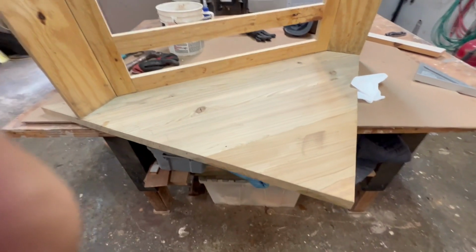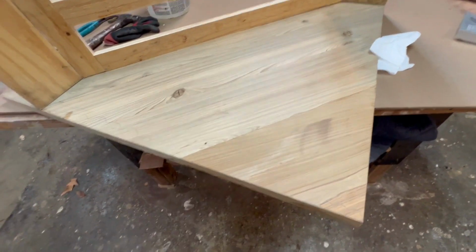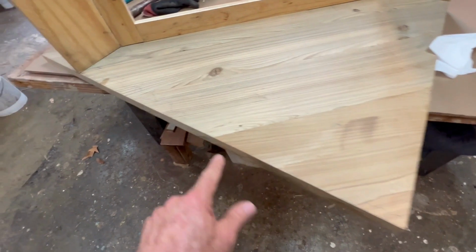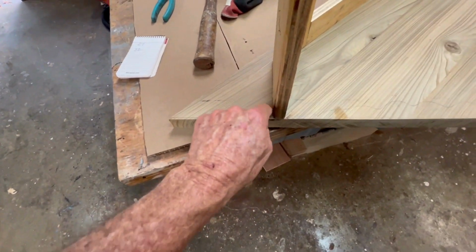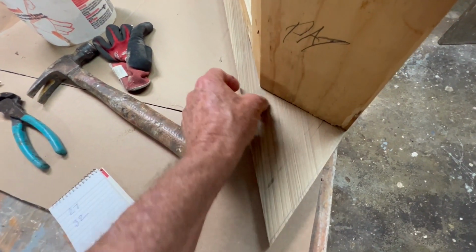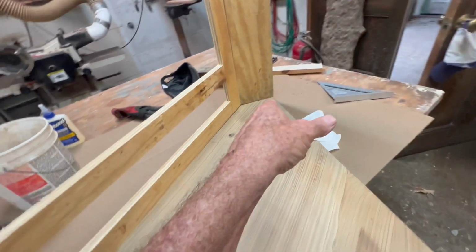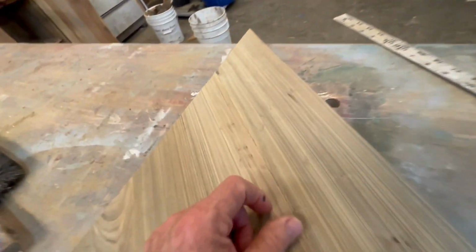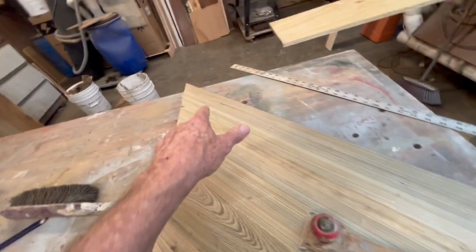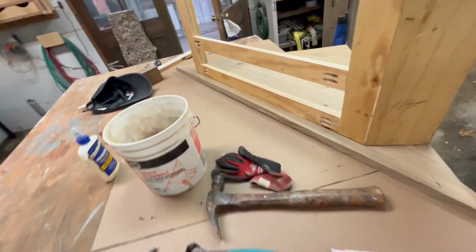So now that the triangular tops are cut to fit the wall, this is no longer a right angle, which kind of changes everything up. So if I come out my 27 inches, turn a right angle and run out, and then put my 1 1/8 inch overhang in the front, I get 5 inches here, but I get 5 1/8 inches there. No, I get 5 inches here and 4 3/4 there, and I'm not sure if I want to do it that way. I think I do. I think I want to keep everything kind of the same.